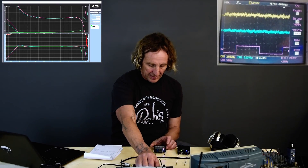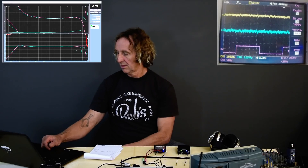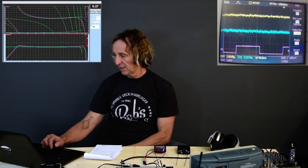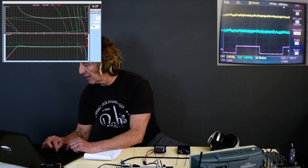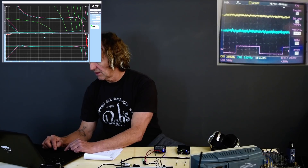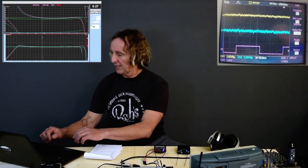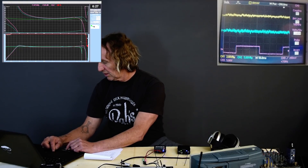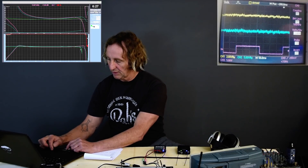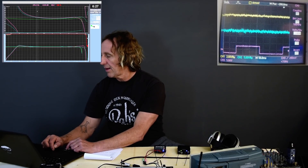Let's take a look at the belt pack. On the transfer function we're seeing an almost identical frequency response, but not identical time latency. The belt pack latency is about 1.88 milliseconds — slightly different from the 1.44 off the unit itself. It looks almost identical in its frequency response for the transfer function. Let's go ahead and save that and go back to spectrum.